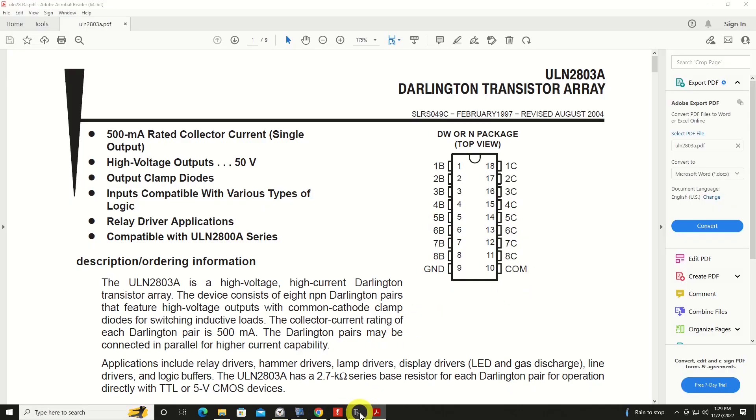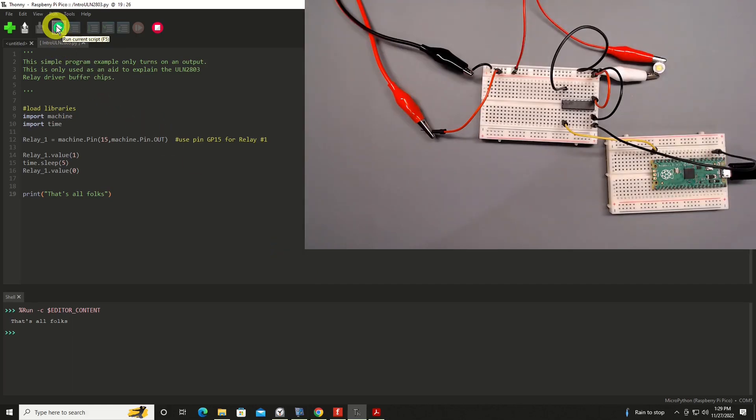Understanding its power kind of needs a demonstration first. Most likely you've powered basic LEDs pushing about 10 to 15 milliamps and they're bright. Well, take a look at what we're going to do here. I'm going to switch over to our program and run it. Hopefully you noticed how bright that was. That is actually a watt and a half of power going into that LED — it's a surface mount LED rated at 1 watt. I'm powering it at 6 volts and it's drawing about 250 milliamps, so a watt and a half.